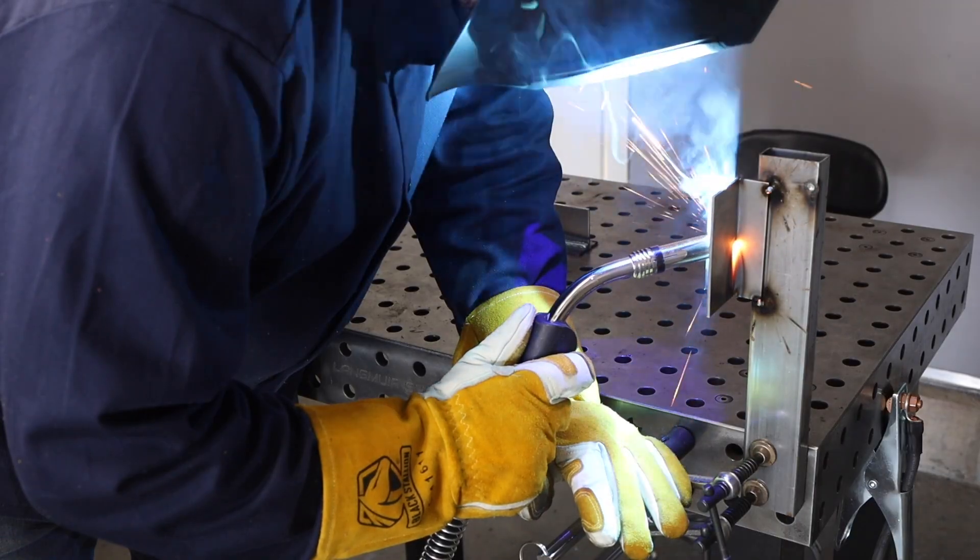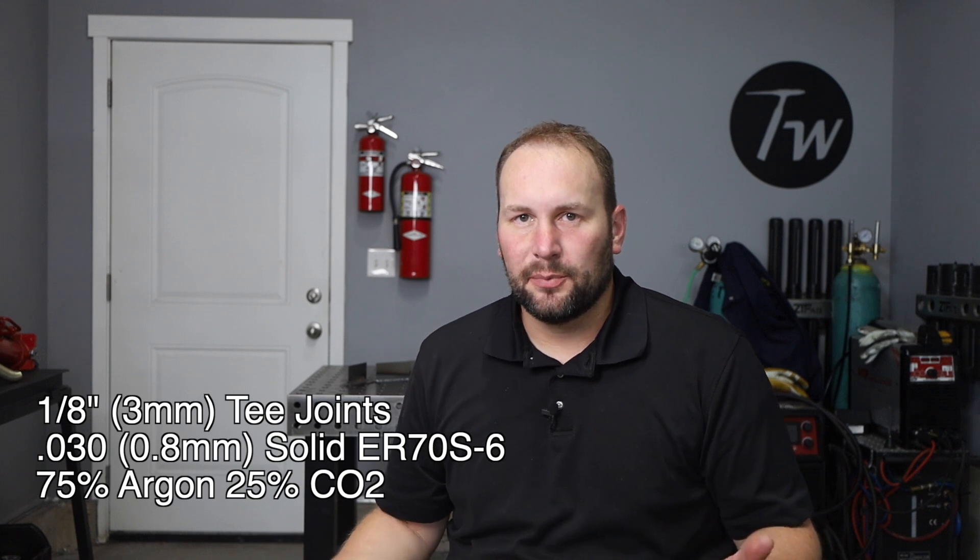So the first thing to decide is what your progression is going to be — are you going to travel vertically up or vertically down? We're going to do both today. I'm welding on 1/8 of an inch thick material and for me that's the threshold between vertical up and vertical down. If you're thinner than that it's a good idea to go down so you don't burn through. Thicker than that, go up so that you actually penetrate into the material.